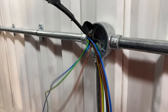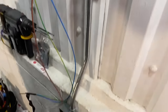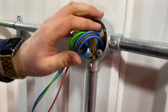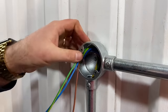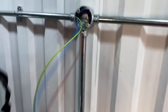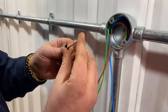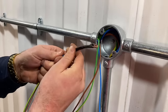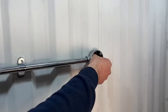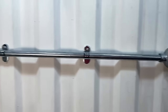We pull those 2.5mm² conductors down to the socket. Then for the short run with the 1.5mm² conductors, there's a good tip: roll the end of the conductor over before pushing it in — if you leave the end straight it can catch at the other end. We push the 1.5s through without a draw-through tape on this short run. They pop through and we leave a tiny little curl of cable at the top of the box, which we'll dress in a moment.